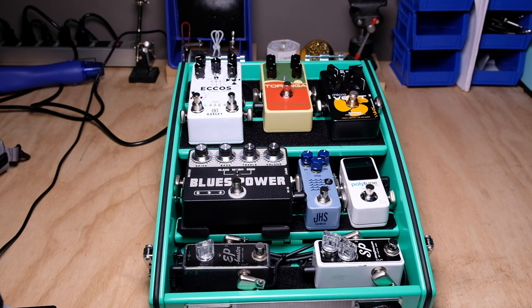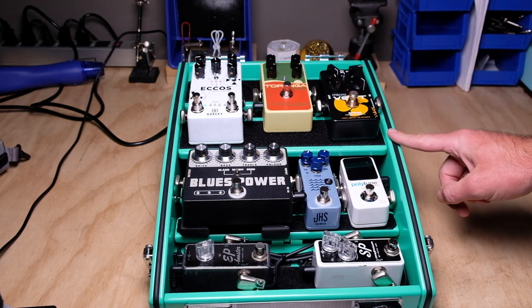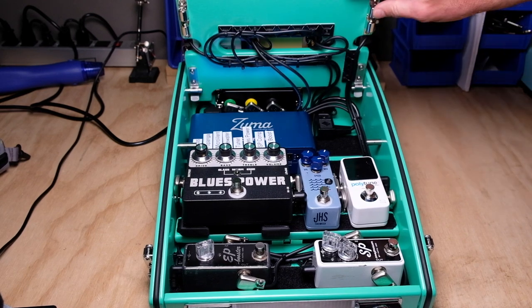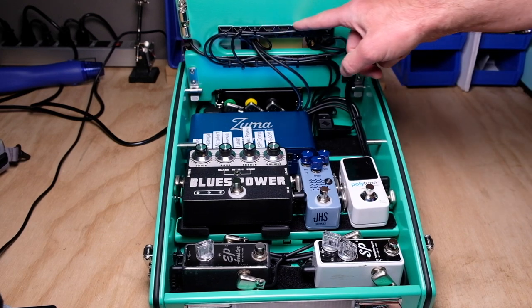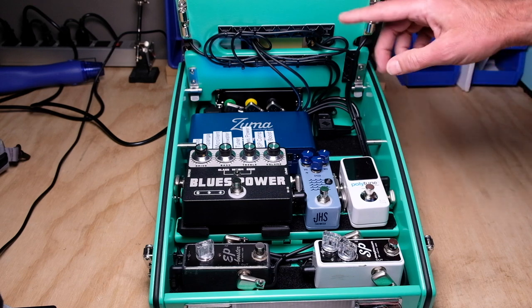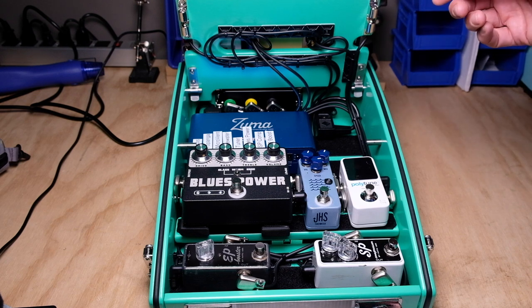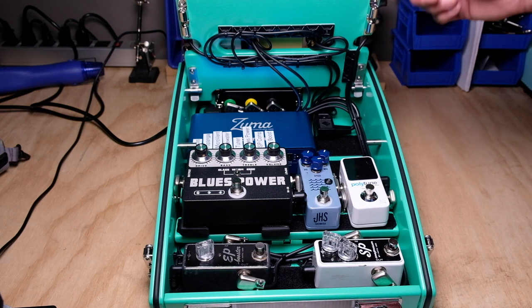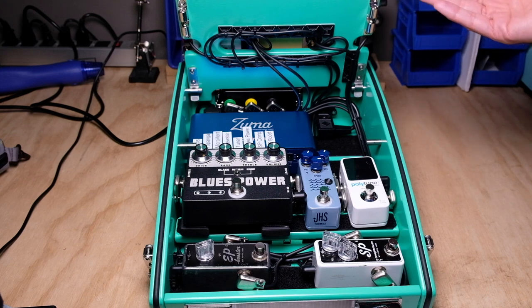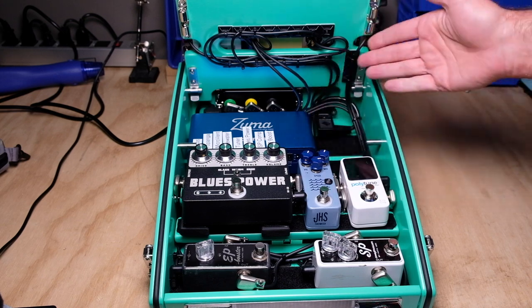We're back with the completed board. Everything went pretty well — it's definitely a little tight. Layout is on top just as the customer wanted, except we did have to make one switch which I'll get into. You can see how things got wired up. I use a lot of cable tie mounts spread around the flat surfaces and I pretty much only put power on those. I put all the power in first and then come through and do the audio, because the power tends not to change as much. Everything on here is nine volt with more or less the same current draw. With 500 milliamps on each port from the Zuma, you don't have to do a lot of juggling — it's a really nice platform to work from because it has so much current headroom.